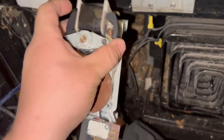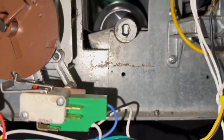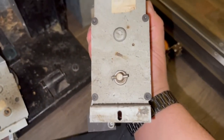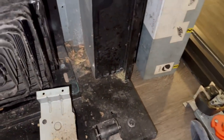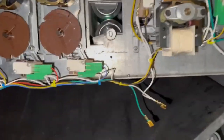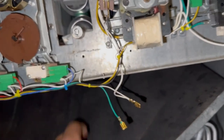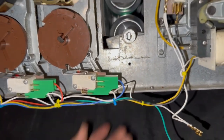Update: I pulled the motor off and determined that the pin connecting to the rotating assembly on this particular motor does not match the spare I had on hand. So I'm going to have to hope it doesn't malfunction before the new board arrives. After testing it, everything is smooth — it rotates smoothly, it's not out of alignment. I don't know why it's acting the way it is. I think it's just a board malfunction.